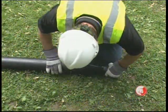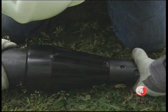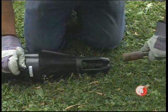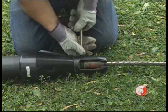Place your quick grip burst head onto the pipe. Secure the burst head to the pipe by pulling and rotating the nose clockwise. Remove the retaining bolt and insert the cable into the socket. Pull the cable forward and reinstall the retaining bolt.